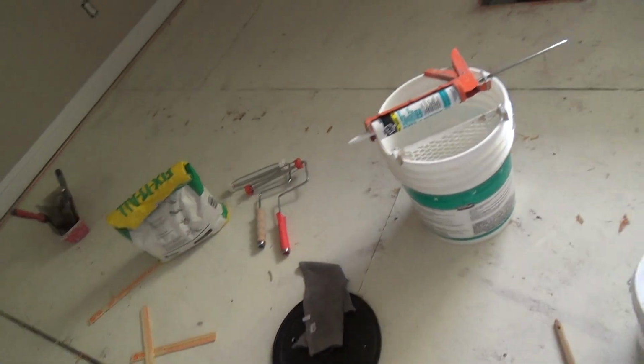And then I'll walk around. I'll march around in all the different door areas, in the walk areas, especially where the seams are. Because if it's going to squeak, it's probably going to be on a seam or on an actual floor joist. And these floor joists are going this direction. I know that because of where the seams are. So as I walk on this seam, I can continue down here, put my weight on there, walk around, and you might surprise yourself. You might find one or two squeaks that you didn't even know were there, and now's the time to fix it, right? And you can fix it.